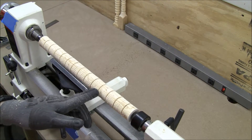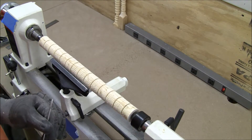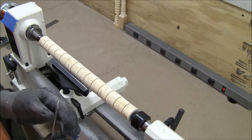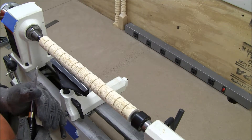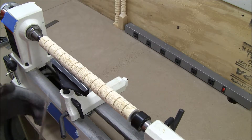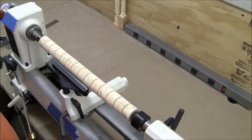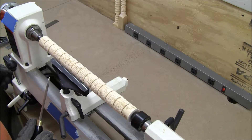Just going between my cuts — as you can see here, I have some lines that I've drawn in so that I can make the half inch cuts, which will work really well for my next project anyway. I'm going to try a slightly higher speed than I was using. I'm going to start at about 1400 RPMs and just give this a try, see if a little higher speed is going to work well for me. I've got my tool rest pretty well positioned, so let's get started.